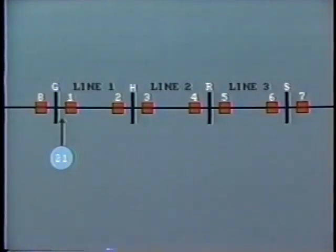Why is this? Well, the main point is we do not want this relay on bus G to trip for faults on the transmission line 2, that is, between buses H and R. Therefore, in order to allow for any impreciseness in actual operation of the relay or the power system, zone 1 is set to operate up to about 80% of the line.